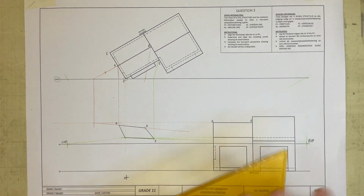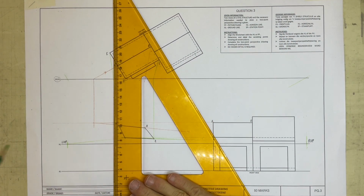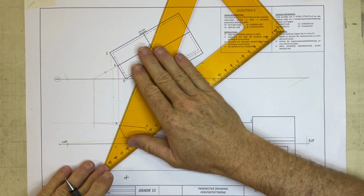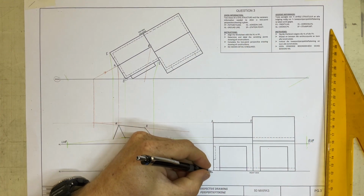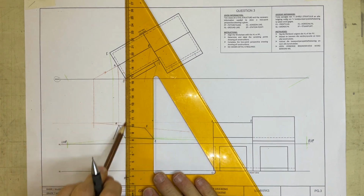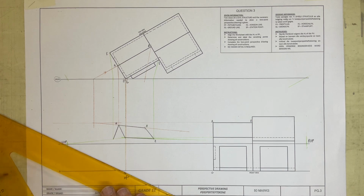What I say here, and if you look over the last, I think, 3 years, they don't want you to do the whole development. There's also not enough space. And what I help you with here, they want you to take it across. So that helps quite a bit. Instead of measuring here and drawing it somewhere else, that's usually where the confusion comes in. If you take it across, just by putting in your straight line there, it will show you point P, so you have to develop that part and that part over here. So for doing a straight line there will be a mark. For putting in the center line, another mark. For getting the height correct, you're taking it across, that's a mark. For measuring the true length that you get from here, mark it off, that's another mark. So you can get, without really understanding what you're looking at, 50% for this question.